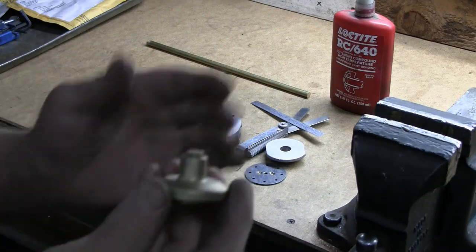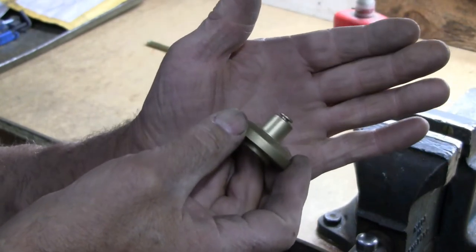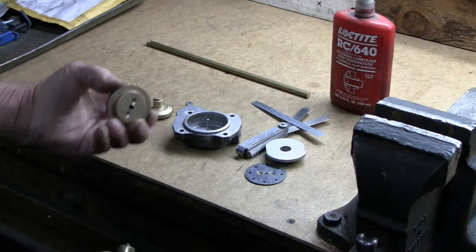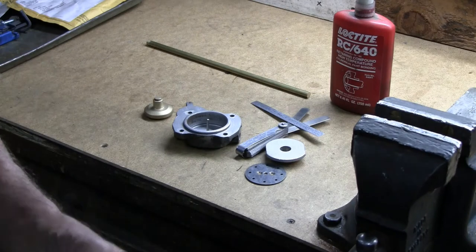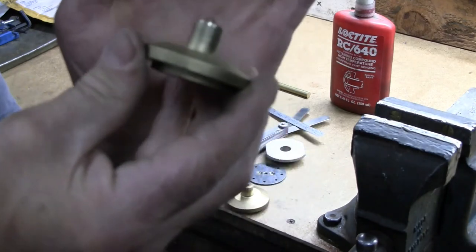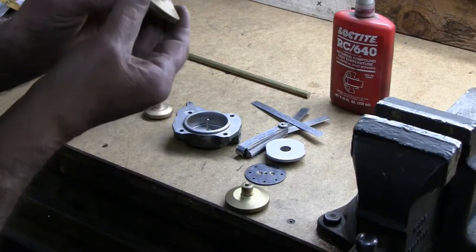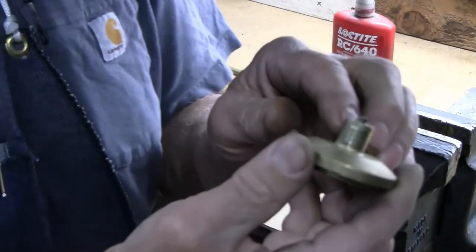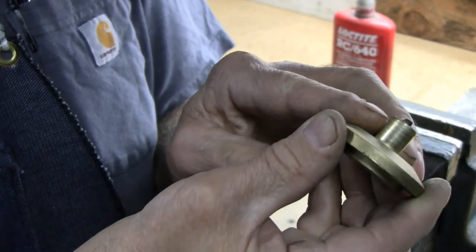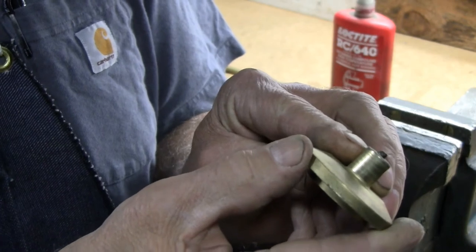So the problem is that this feature is fragile, and when people are taking these apart using screwdrivers and vice grip pliers and similar tools, Bubba tools, as Mr. Pete calls them, the retaining collar gets broken off, and these two pistons have that issue. The distance from this surface under my fingernail to the end of the counterbore in here is only about 50 thousandths of an inch.